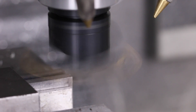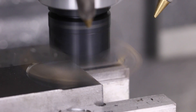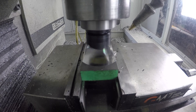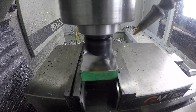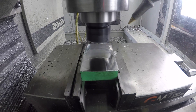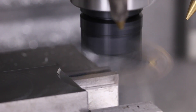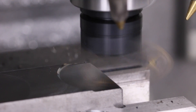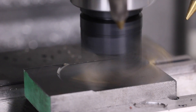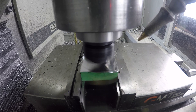Running the Superfly at 1200 RPMs, 10 or so inches a minute, 45 thou depth of cut — pretty nice cut. The chips are coming off blue, which is awesome — you're putting the heat into the chip, which means the heat's not in the work. It actually improves cutter life and cut quality, and I like that HSM programming the face-off takes the user element out of it. It's pretty cool to see all that heat in those deep blue chips.